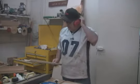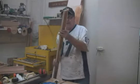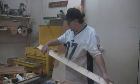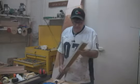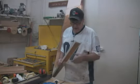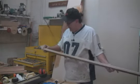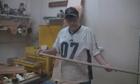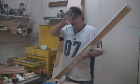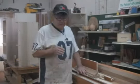All right. Now I'm not as smooth as I'd like to be, but I had an issue. So now I'm down to where I want and I'm good. These take a fair amount of sanding, no matter what you do. So all of that will sand up and clean up pretty nice. So we're going to be okay. And we've got a nice little 1/4 inch reveal. Now we're going to come back and put this on the top part of the crown. And we'll be good.